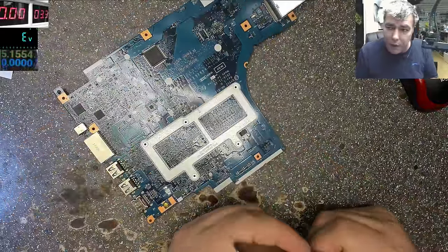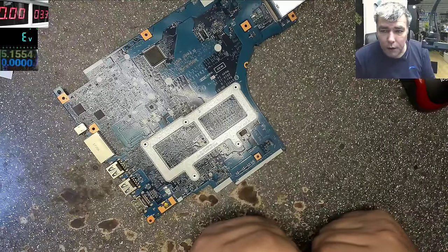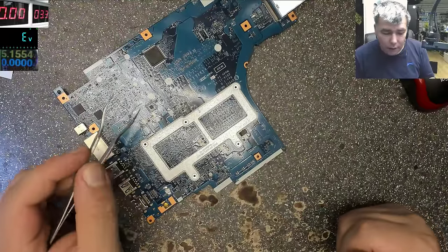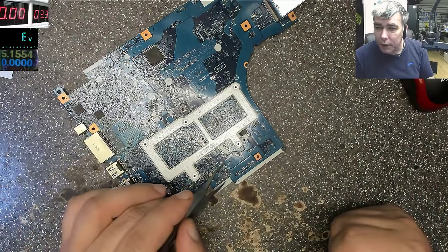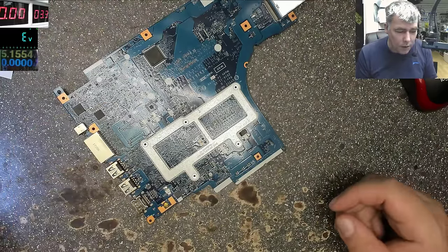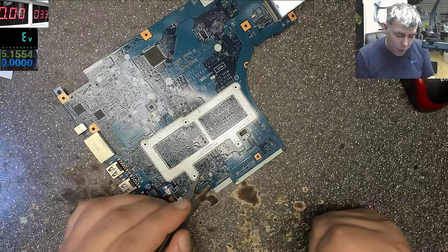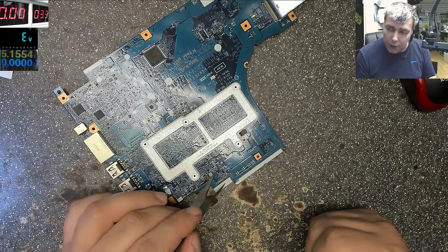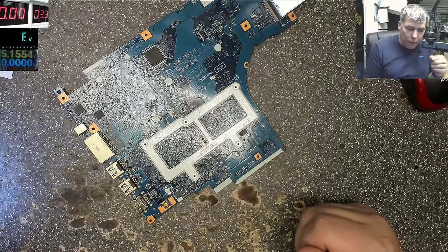Because if you play on the battery, if you have an issue with the battery, I don't know, you have two tracks. Yeah? The clock and the data, which is coming from the Super IO down to the battery. And the Super IO is speaking with the battery, starting the charging, stopping the charger, checking the level of the battery. So that's the only way the Super IO can die, because someone plays on the battery or something goes wrong with the battery. Okay?